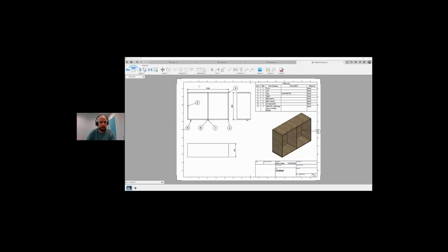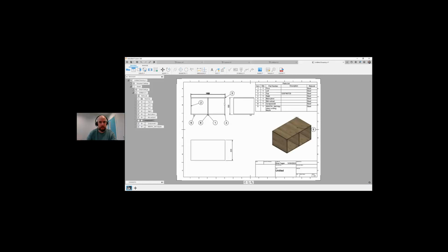And we'll notice that over here it's telling us that something has changed within this model. The minute I click this, you'll see the 1200, the 800, and the 400 all update very quickly. There we go. So now we're 1500 and 600, so you can see the model changes very quickly. So everything is very streamlined within Fusion, and it's very simple to do all these updates. Obviously, because we've changed this, we'd have to go into the top plate, right click, go into the properties, because over here it's still telling us that it's 1200. So this is the only area that you want to be careful of. But again, you don't need to put in the description of the dimensions, because your dimensions should be all covered inside here also.